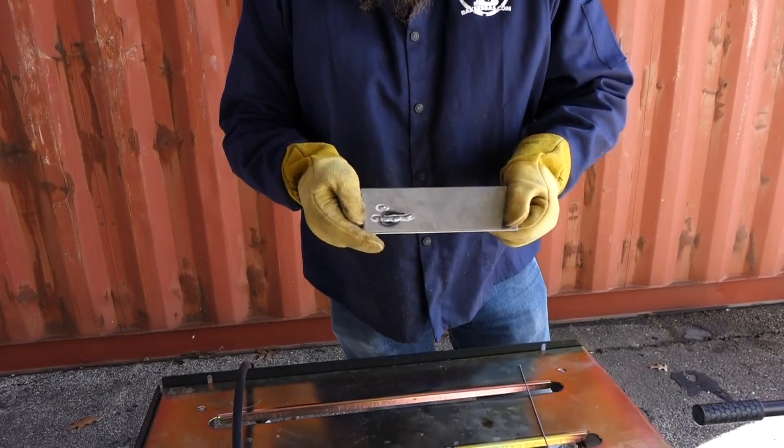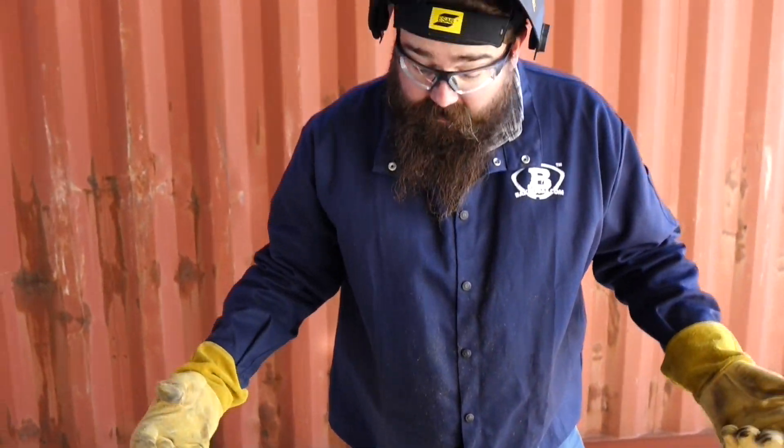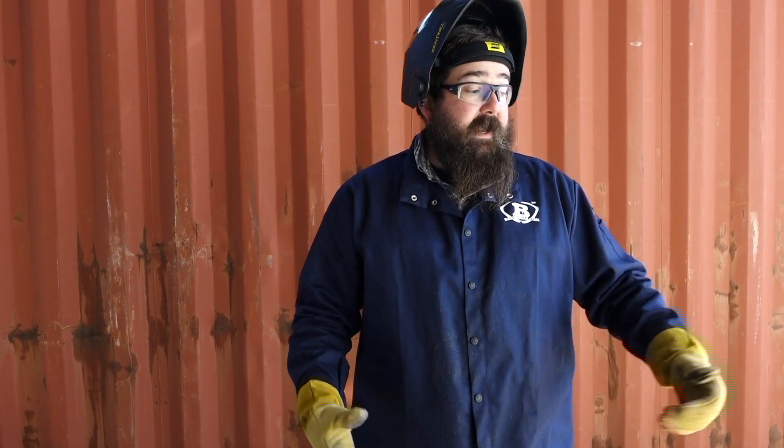Got a little dirty piece of aluminum, but not too bad. It ran 160 amps on the 205 — ran good. We did try higher amperage and it trips the breaker on that 205, but it's doable with a lower wattage unit. 8,800 watts is recommended for maximum output, but we're obviously on a 4,500 watt max output generator.